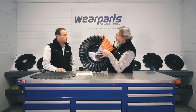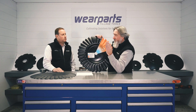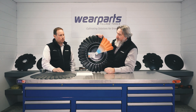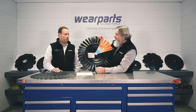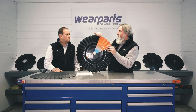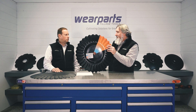The second zone at 50 to 55 gives you excellent durability, keeping that blade stiff from there all the way out, making sure that it's not going to be bending. It's going to really last a long time and not start to deform. And then as you get farther out to the edge, there's a third zone of heat treat, which is all the way up to 55 to 58 Rockwell C — really hard, really high end heat treating. That'll keep that edge sharp and lasting a long time, with the hardest zone right on the outside.